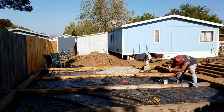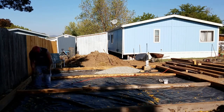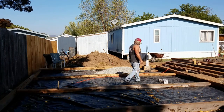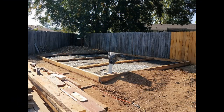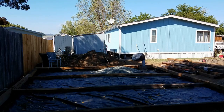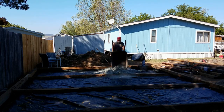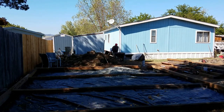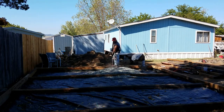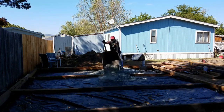They were pieced together, screwed in, screwed down, and then holes drilled and 2-foot rebar stakes driven through them, securing them to the ground. And here we have the first picture of the deadmen installed. Now, I did go ahead and bring in a few wheelbarrows full of gravel, mainly to cover a seam to keep the wind from blowing the road fabric all over the place, but also to provide a base for the skid steer to be able to get over the deadmen.